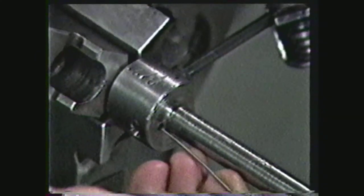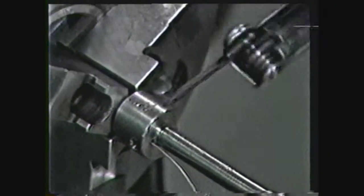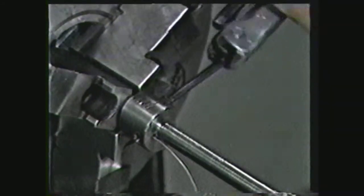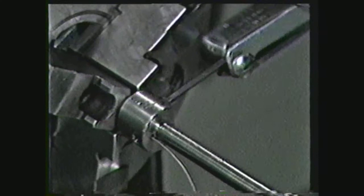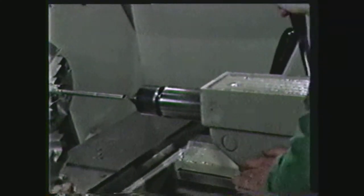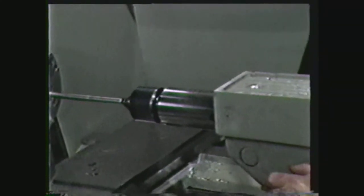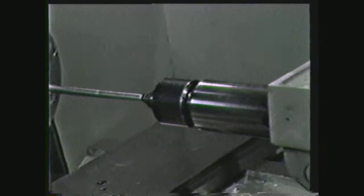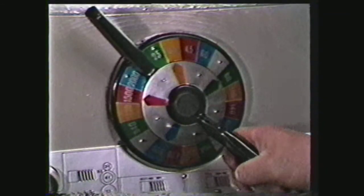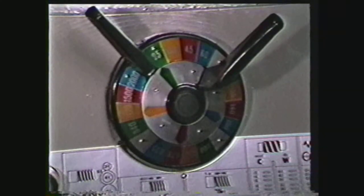One end of the wire is held in place by either fastening it between a chuck jaw and the mandrel, or by passing it through a hole in the mandrel. Whenever a mandrel of less than three-eighths inch diameter is used, the end of the mandrel is supported by a tailstock center to maintain its rigidity. The spindle speed of the lathe is geared down to the same speed as is used in cutting screws.